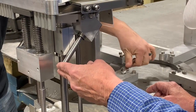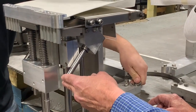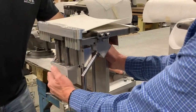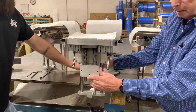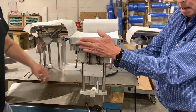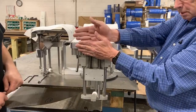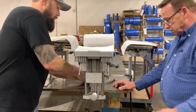And when we loosen them bolts back there, we're going to see that we can move this bag table. Now, if you can get on the square end of that, we can move this bag table like this, and that's going to get us parallel with the front of the machine. So the front of the machine and the bag table are parallel. All right, snug one of them down back there, son. We'll see what we can go to now.